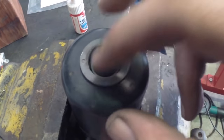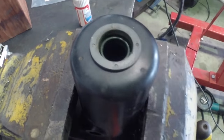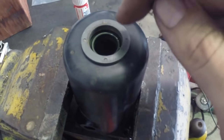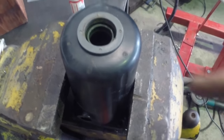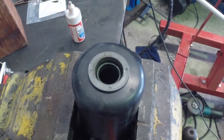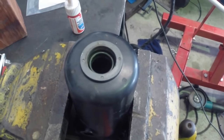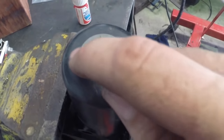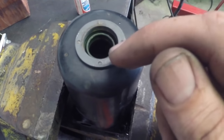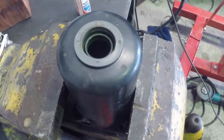I'll let that set. If any Honda guys know what's normally used let me know — this is a plastic housing and a plastic ring, it's not threaded or anything like that so there's no other way to hold it in. Just making sure I didn't get any on the o-ring itself. Whatever you use, make sure you don't use very much because you may need to pull this out again, and you don't want it getting all over the inner surface of this oil seal.